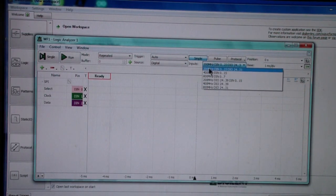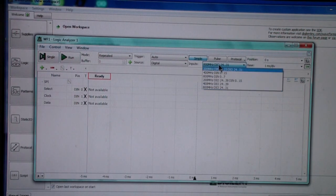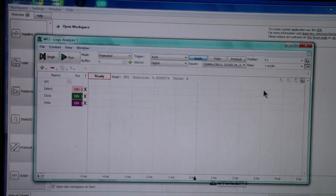Available sample rates range from 200 MHz up to 800 MHz. Note that this is sample rate, not the input bandwidth — input bandwidth is limited to 100 MHz. So at 200 MHz sampling on a 100 MHz signal, you are sampling at the Nyquist minimum of two samples per cycle; at 800 MHz you are oversampling at four times the Nyquist minimum. However, the SPI bus decode is marked as 'not available' at these highest rates. Now let's move on to some experiments with the logic analyzer.